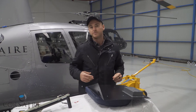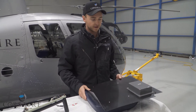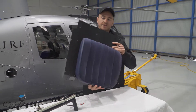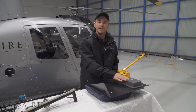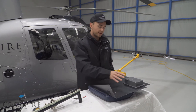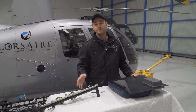Here on the workbench we've got a couple of the components we just discussed in the cockpit. This is our governor controller, located on the back of the left-hand seat back, hard mounted with a couple of screws. This will read a signal off our right-hand magneto, sense changes in our engine RPM, and it's the governor controller's job to send a corrective input to our governor motor.